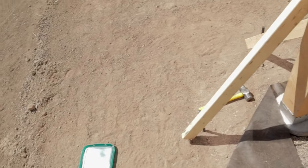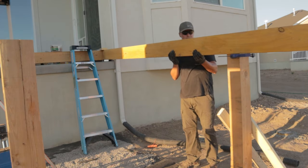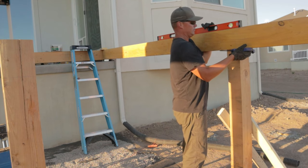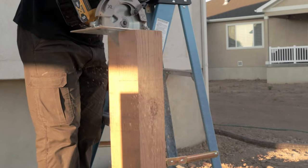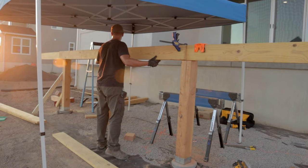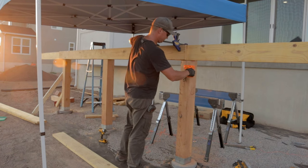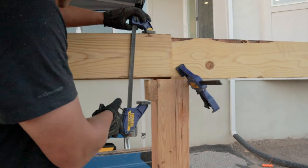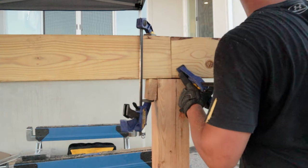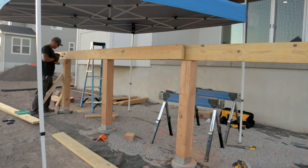To keep the post level I use a 2x4 to help anchor it in place. The beam attaches to the post sitting on a notch — I ran a board from the upper deck and checked level to make sure my cuts are square. I marked the post to notch out a shelf, cut what I could with a circular saw, and finished with a sawzall. Because the boards didn't reach across all four posts I staggered the joints so they didn't fall on the same post. Getting good clamps will help you pull boards where you need them. Once the beams were set I used lag bolts to attach them to the posts.